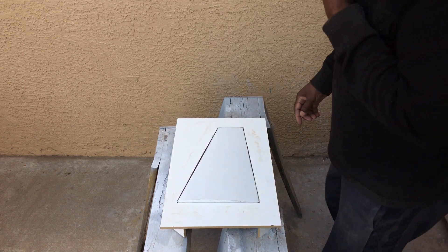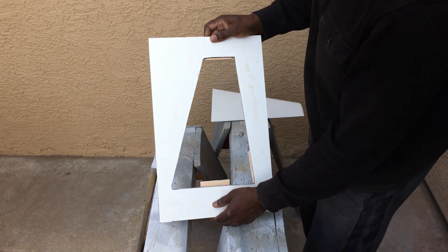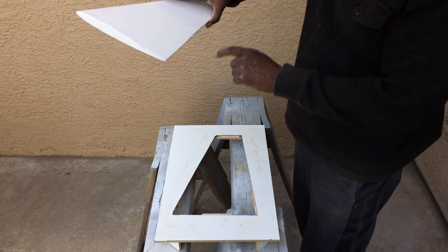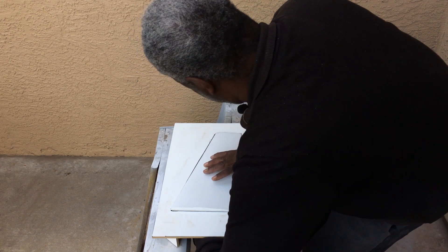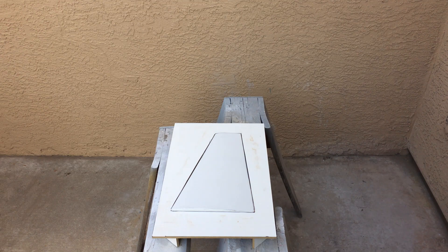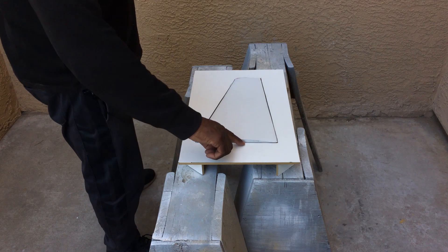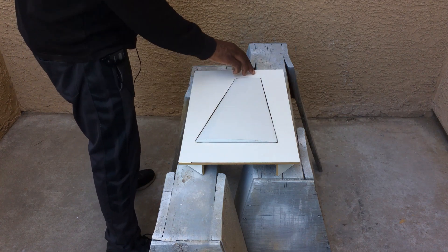What I've done is made shims inside the splitter plate so the stab doesn't fall through and it sits halfway in there — so half of it is up all around here and it goes back down in here just like that. Here we have the plug sitting down in the splitter plate halfway, and now I'm going to take clay and put it all around in the gap here — it's maybe about a two to three millimeter gap — and fill that little gap with clay.